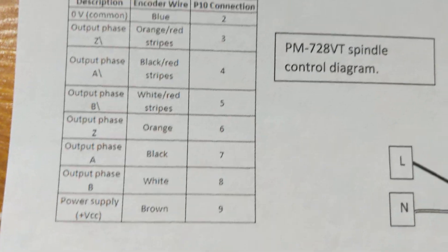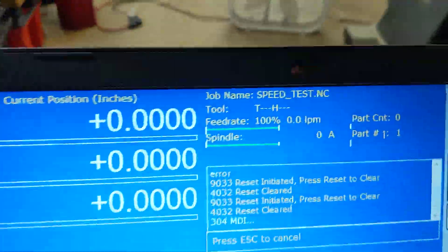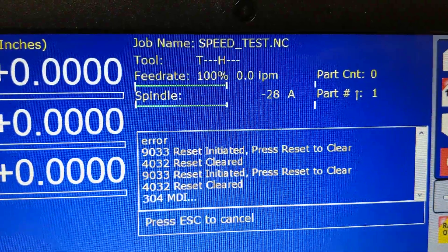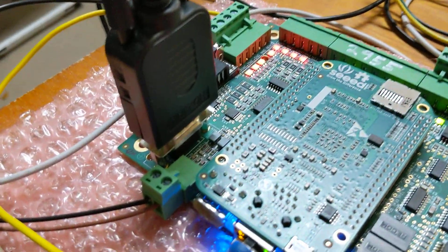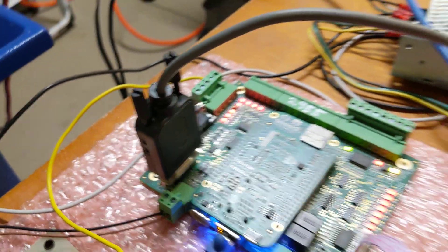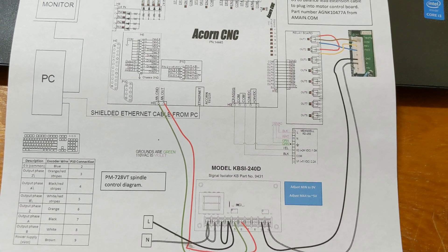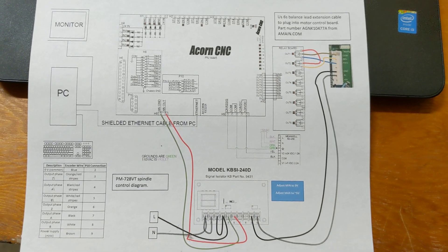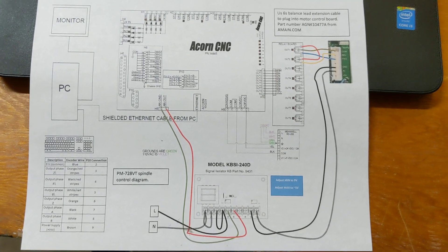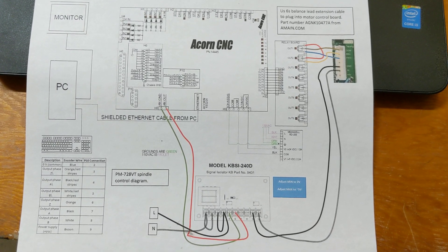This chart shows you how to wire up your encoder. I don't have the encoder mounted to the machine yet — it's just sitting on the bench — and you can see it's providing feedback when I spin it slowly. It plugs into the Acorn with one of those DB9 adapter boards. This is actually a simple process, way easier than I made it out to be when I started. Hopefully you'll benefit from my mistakes — it should be straightforward to hook up without worrying about frying anything.